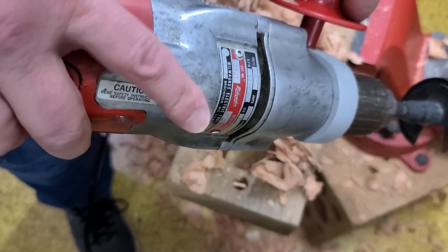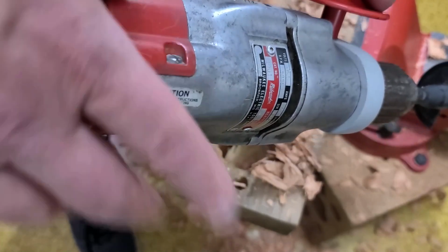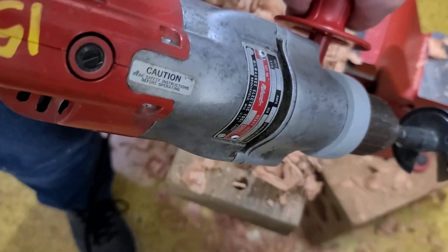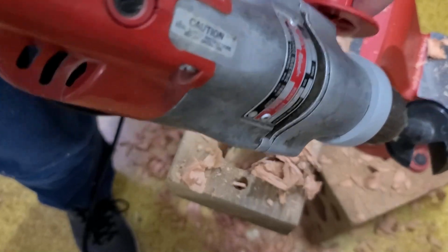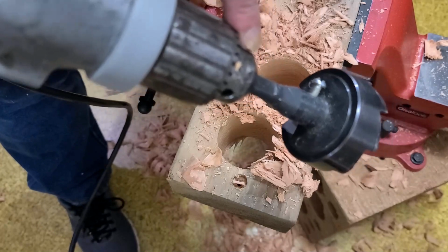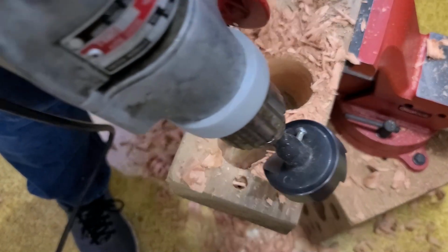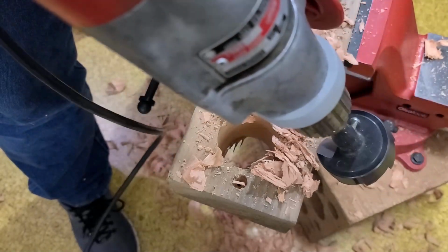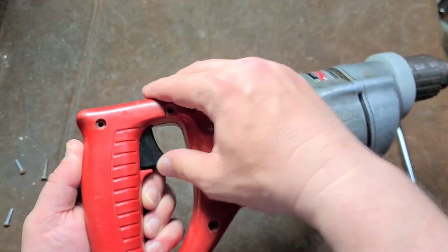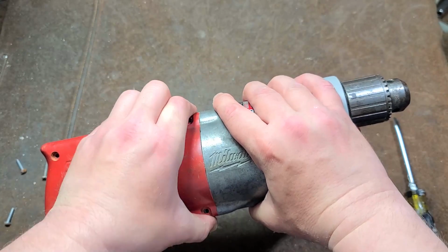Drilling in mild steel with a 1/2-inch drill bit, you're supposed to be running about 720 RPM. This is a little bit slower, but it would be great for, once again, 1/2-inch size holes in steel and other general kind of drilling duties. Just 65 millimeter or 2 9/16 self-feed bits may be a bit much for regular usage. You may overheat it. Taking a quick look-see at the electrics here, if we can get this thing to... There we go.